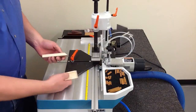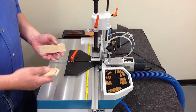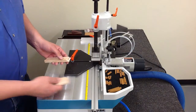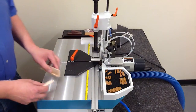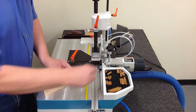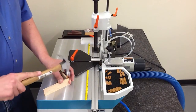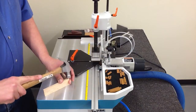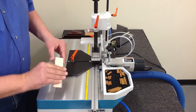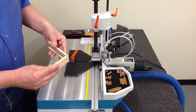And if you assemble your frame for good, you would obviously do it on a flat work surface. We recommend maybe put some mat board down. Also apply a line of glue here on your joint. I'm just going to assemble these here on the machine table for demonstration. So you slide your two parts together. Start the key, and then just carefully tap it over. And there we go. Close the joint right tight.